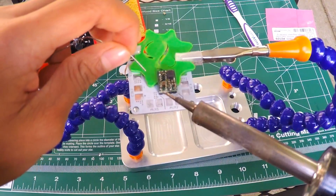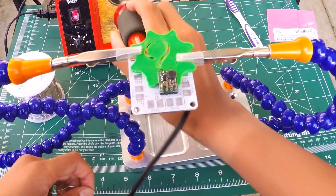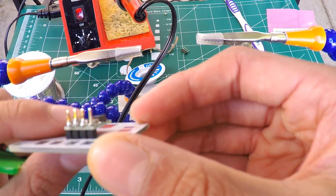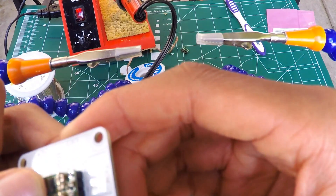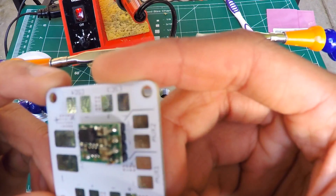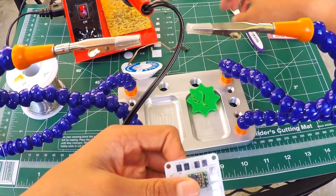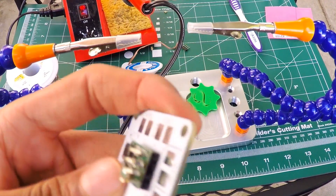Nice and quick — done. Fix your solder joints if you made any screw-ups. There you have it, it's all soldered up nice and neat. See that gap? Make sure it's all nice and flushed down on the board — very nice and secure. Just go over with the magnifying glass and look for any mishaps, or if you put too little or too much solder. I just went over with the magnifying glass, found a little screw-up, and fixed it. Make sure none of the pads are touching each other because you do not want those things to short.